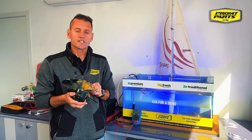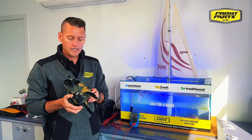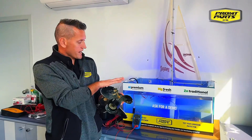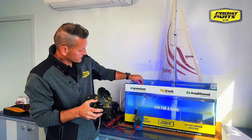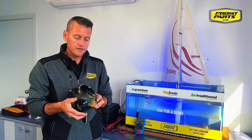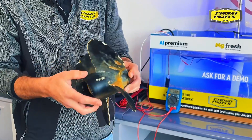This is a brand new propeller. We set up a similar test a couple of weeks ago — it was brand new, nice and black. We put it into a tank similar to this with a bolt in the water, much like our cable here, with 12 volts applied to it simulating a stray current. This is the damage that occurred after just seven days.